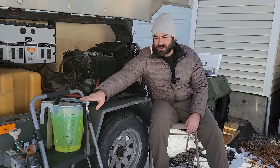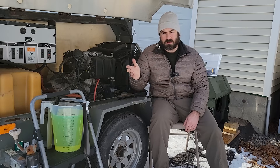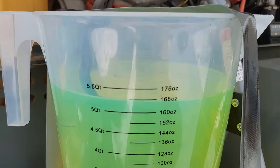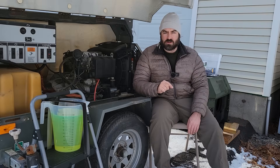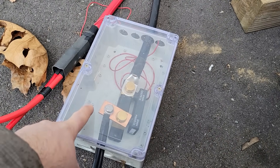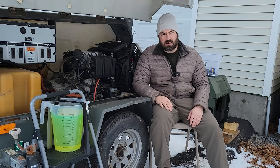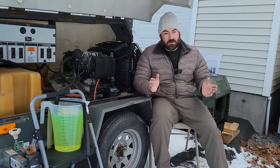Just like in the past videos, I have my little measuring cup here as my external fuel tank. The supply and return hoses are in there — diesels have two hoses, one is the supply, one is the return, because the diesel fuel is both a lubricant and a coolant for the injectors. I filled this container up a little bit beyond five quarts so we can run it for a few minutes, warm everything up, make sure we're running good and have all the air bubbles out. Once the fuel level reaches five quarts, I will start the timer and reset the history on the Victron shunt. This is the Victron smart shunt — this is how we'll measure all the power flow into the battery, which is just beyond the garage door. We'll be monitoring this with the app on my phone, so whatever losses we have in the charger, cords, or anything like that are all being taken into account. We're just measuring fuel in to kilowatt hours into the battery. Let's start the test.